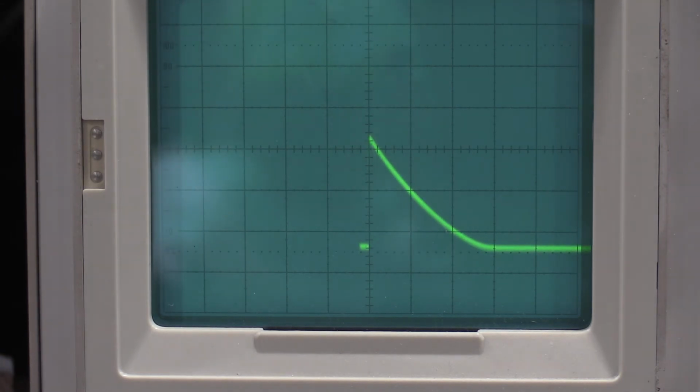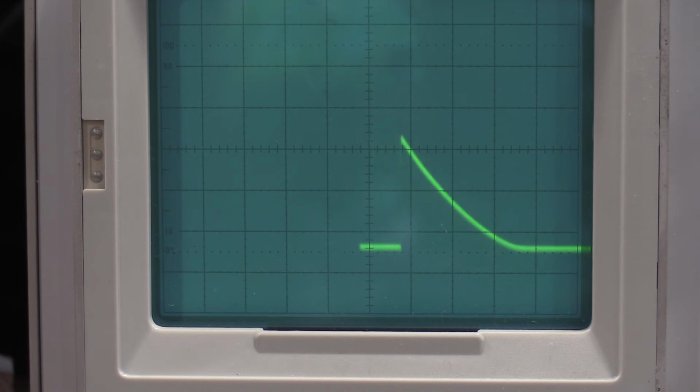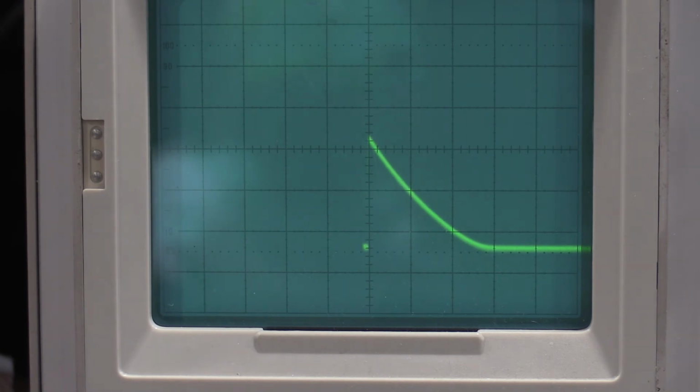All right, we have a little bit too long of a tail, just a touch too long of a tail at the start point, so we're gonna do our 576. And we're gonna back it off. That's too much. Just slightly, right there. Gives us a good start point, and that is exactly at 1.0 on the delayed sweep dial. So we are good on the sweep.